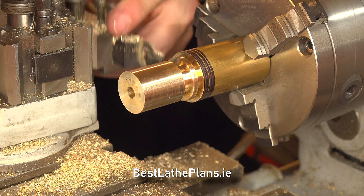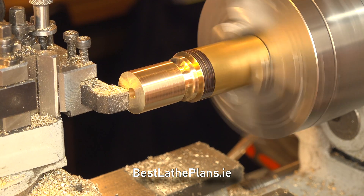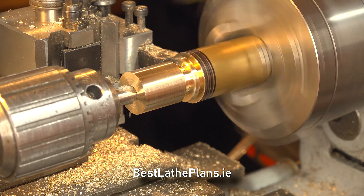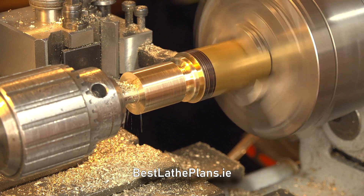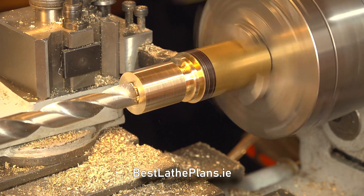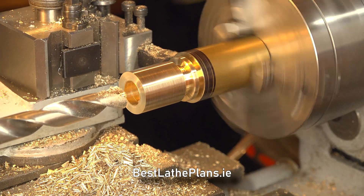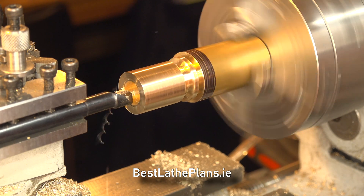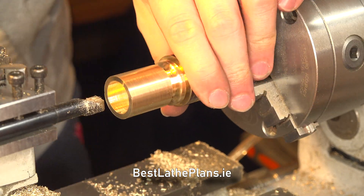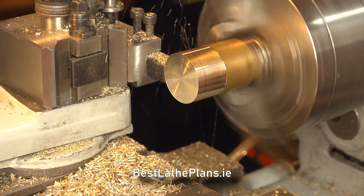Now we move back up to the other end of the work. I switched back to the roughing tool and removed the tailstock live centre, then took a light facing cut and re-drilled the centre hole using a large centre drill. The hole was then enlarged using a twist drill. This is where things started getting a bit funky — as you can hear, the twist drill is causing some chatter due to the large stick out of the work from the chuck and the lack of any other support. To widen the hole further I needed to use a boring bar, and during that process the boring bar actually bit into the work and knocked it very out of alignment. I decided to turn the work around in the chuck and make a light cut on the area that was going to be gripped by the jaws, and also faced the rear end so that it could seat nicely against the back of the chuck.